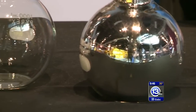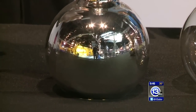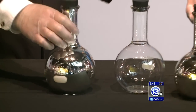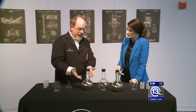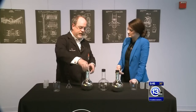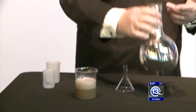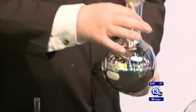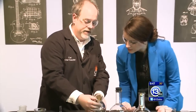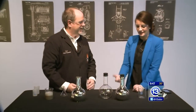This is how mirrors are typically made, because it doesn't require any electricity or electroplating. There certainly are other ways to coat mirrors with a shiny substance — vapor deposition, sputtering — but this is so clean and nice. Three chemicals mixed together plate out silver, and this will last just like a regular silver mirror. We would pull out the leftover chemicals and coat the inside with a little bit of paint to protect the very, very thin layer of silver. You've made a silver ornament for your desktop, and that was in a matter of minutes — seconds, almost.